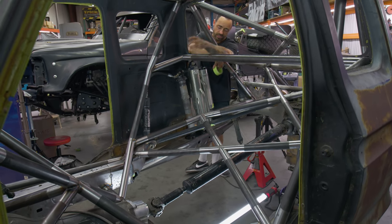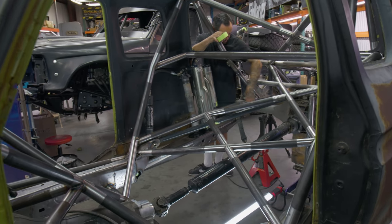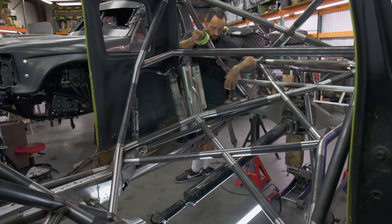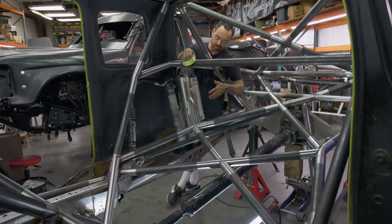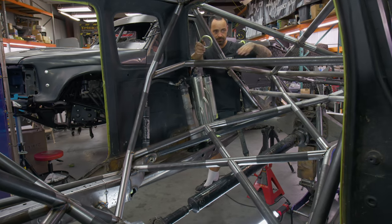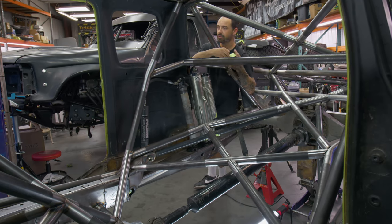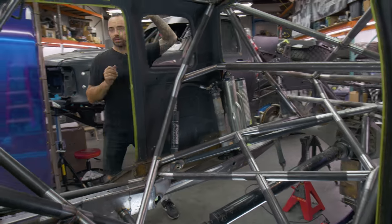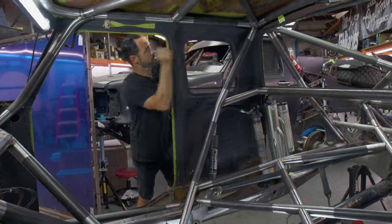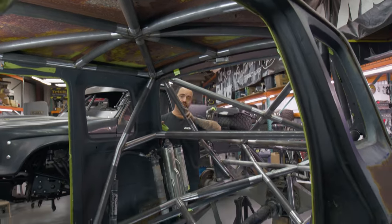That was our initial. And like I said, there used to be a big gnarly rectangular box frame rail where this tube was going into this existing portion of the chassis. We wanted to use that almost as a fixture to build into, and then build enough on top and in the middle section to just cut that part out and then lace it back up. So that being said, we constructed enough structure. Again, the A pillar went up, ran these tubes, built this whole portion, which we'll come back and talk about too, all the down tube section.